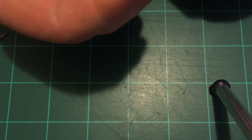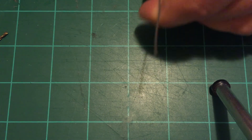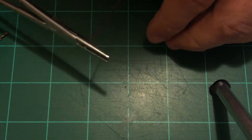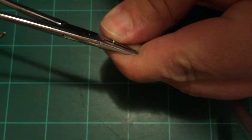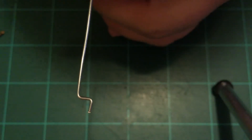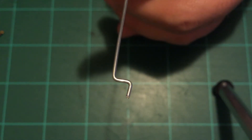I just take a little piece of this, and if I want to make a Z-bend in it, I'll take my handy dandy hemostats right here, grab a hold of this wire, make one bend straight down, then grab it up here and make another bend — and there you go. That's been working for me all the way up into the 400-size planes. If you keep them short enough, you don't have much problem with them.